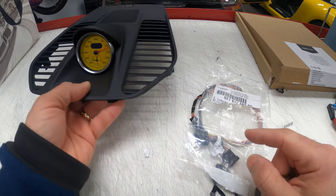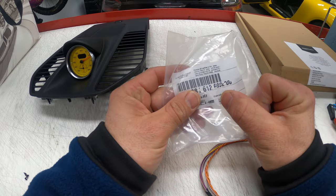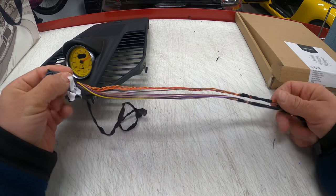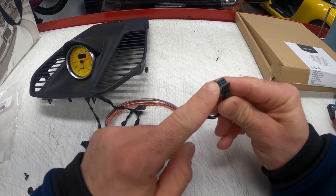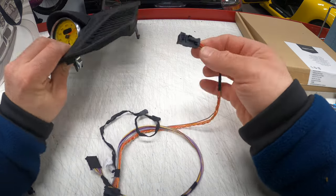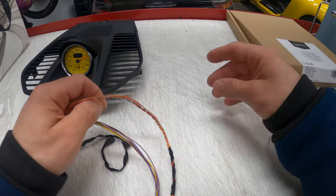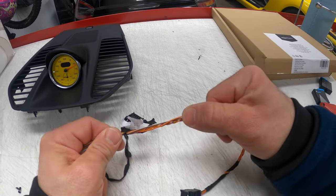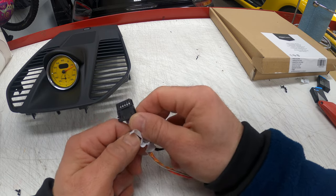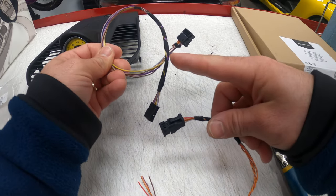I'm at my workbench now. I've got my new sport chrono clock. I also have this wiring cable that I purchased — I'll put the part number in the description. Essentially, this is a connector that connects to a 981 Cayman: the connector has one big piece on one side and splits into a Y connector. We're only interested in the tiny square-looking one, which connects to the back of the sport chrono. We want to separate the Y — this was actually taped up, so I undid the tape. You want to remove the Y and you're only interested in this cable here.